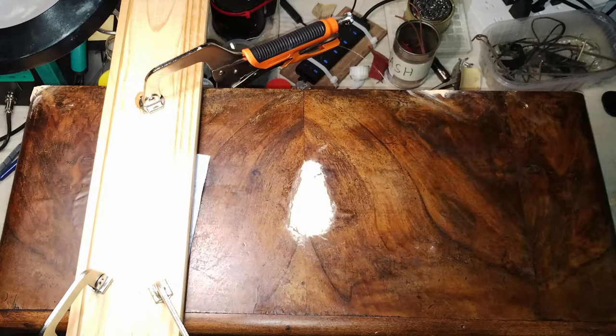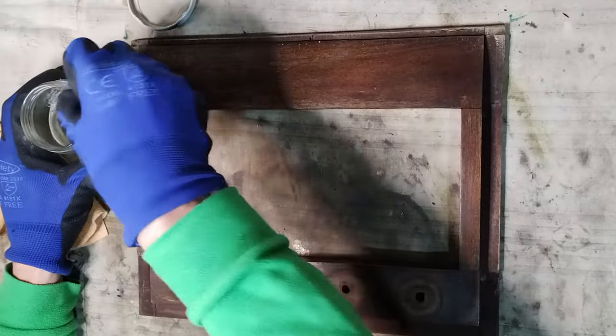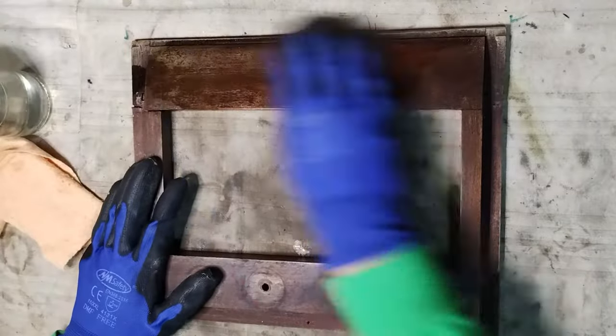Later, the areas without veneer are filled with some wood filler that should then be stained with a brown marker. However, it would have been much better using a wood filler already of a darker color. This is the example of the treatment that all the external surfaces of the cabinet received.